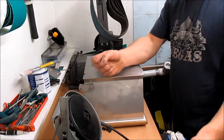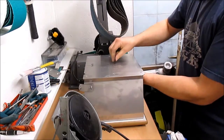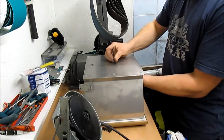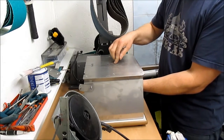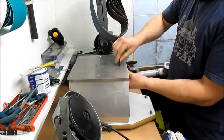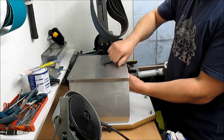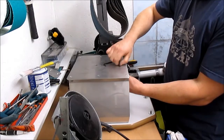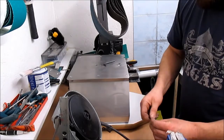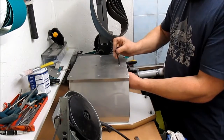All the tools you're going to need is the Allen key that comes with it, and a 10mm spanner. So it'll come all assembled. So just unscrew the front mount just a little bit. The back mount, take that one right out. Always supplying slightly shorter screws, the only ones I had at the time, and this one is actually threaded into the plate.